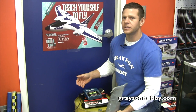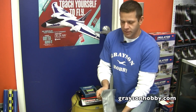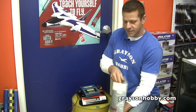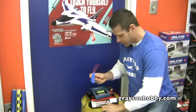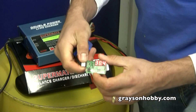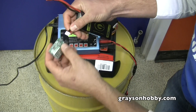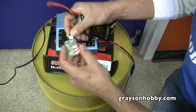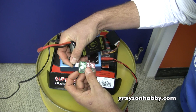I'm going to show you how to store your batteries using this Dynam Supermate LiPo charger — it's real simple to do. First, get your battery packs out of their protective LiPo bag. I'll pull out this one here and give it a quick check — 3.84 volts, which is about right, that's what we're looking for. Now I'll take my second pack, the one I just used — 3.7 volts, so this pack is very low and I need to bring it up to the storage voltage.